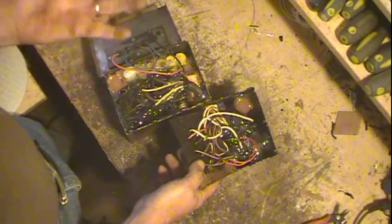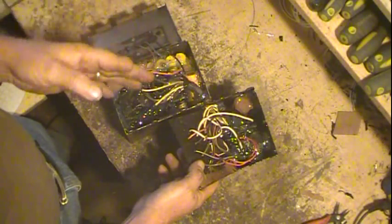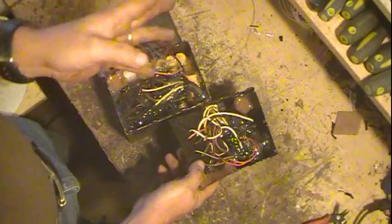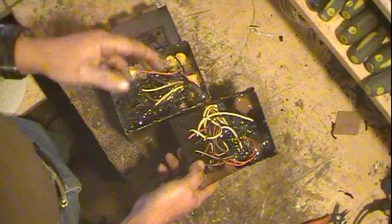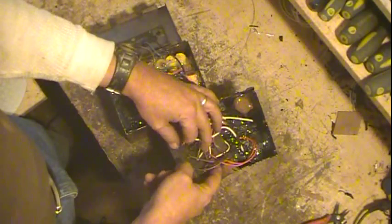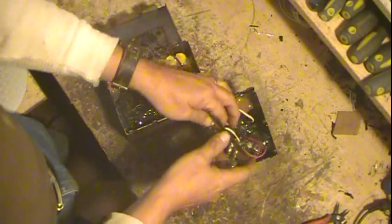And the general standard value is between 20 and 40 ohms, depending on what voltage. If it's 3.5 volt, 3.3 to 5 volts, it's usually closer to 40 ohms, or you can generally use 40. For 1.5 and 2.5 volts, you use 20 ohms. So it's just two 10 ohm resistors, and they're just located right here. One's here and one's there. Where they come together, that's going to be the center tap. That'll be where the wire actually hooks for the center tap.